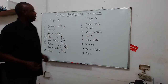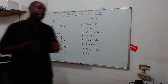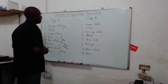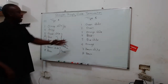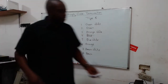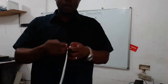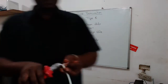For Type B: green-white, green, orange-white, blue, blue-white, orange, brown-white, brown. The rule for preparing cables is: to make a straight-through cable, make both ends Type A. For a crossover cable, make one end Type A and the other end Type B. I've already stripped this cable. If you want to arrange the wires cleanly, you first have to cut off the center member.